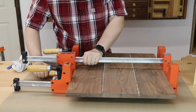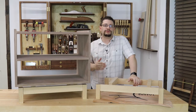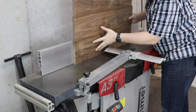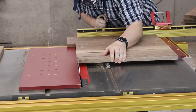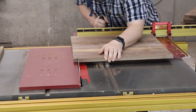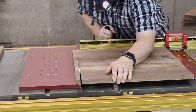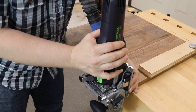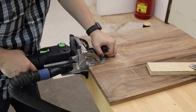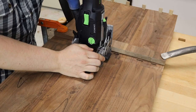The panels were all just a little bit too wide, so I took those over to the jointer, jointed one edge, and cut everything to width, and then I cut everything to length. With all that done, I was able to come back in and do all the joinery with the Dominos to connect the vertical panels to the horizontal panels.